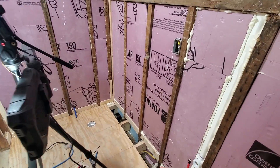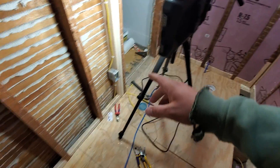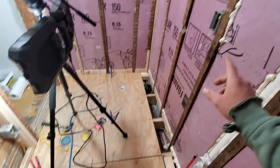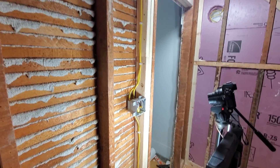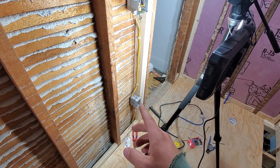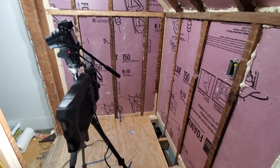With the way the wire is running in this particular installation, we would have to install a GFCI receptacle here as well as a GFCI receptacle right there, because the power comes into this box, goes over to there, and up into the lights. In order for the lights and fan not to be on the GFCI load side, we need a point-of-use GFCI at each receptacle location, since we wouldn't be able to use the load side of one of those GFCI receptacles.